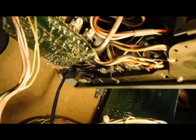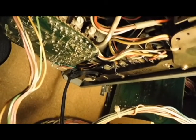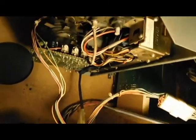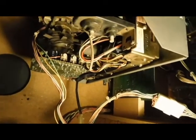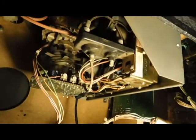We are back and we're going to go ahead and adjust the monitor just a little bit, see if that shakiness kind of goes away. It's kind of a tight fit in these cocktails — right there, that's the horizontal frequency potentiometer. So we are going to take our little screwdriver and try to adjust that very, very slowly because it's just shaking a little bit. It might not even have to do with that potentiometer because I did completely rebuild this monitor and the potentiometer was working fine. So it could still be an issue on the board.